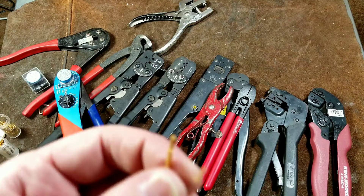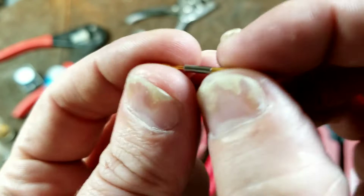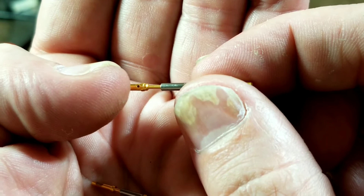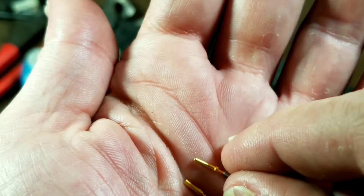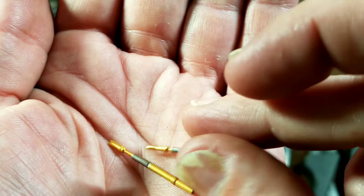To finish up with this Daniels tool — I surprisingly do have some terminals. I found a couple little jars with some very odd, very fine wire terminals — some very tiny ones and some larger ones. This side is actually the socket, and it has a little extra metal collar to provide spring tension — this is where the little plug goes. You have a pin with a little hole so you can put in the wire and solder it — the hole lets the air bubble escape so the solder goes all the way through the terminal. Then you can crimp it in this Daniels tool, or just crimp them alone, but most times you'd solder and then crimp on top. These are the type of terminals where you might use 30 or 32 gauge wire — some 28 gauge, some 32 gauge. These things are just tiny — maybe 20 average human hairs might fit in the end.